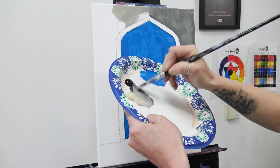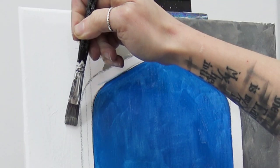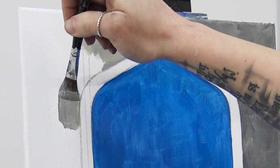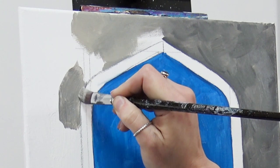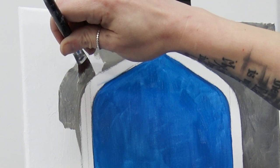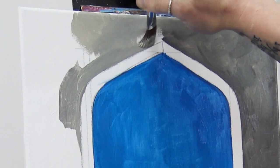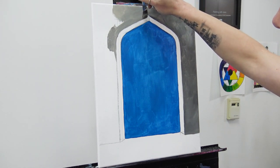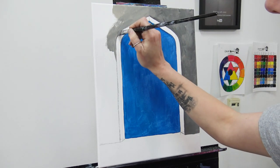Remember to get a nice crisp edge. You don't want to draw your edge by pushing the brush flat because as you push harder the brush gets wider and you can lose control of your line. Also, you can see that little ball of paint getting pushed to that edge — you don't want that. You want to use the tip of the brush because it doesn't matter how much you push, it's not going to get any longer or extend over that line, and you don't get that ball of paint right there on the edge. Once you've drawn your line, you can definitely go behind it and go flat. Just use the tip of the brush to get that line on there in the first place.